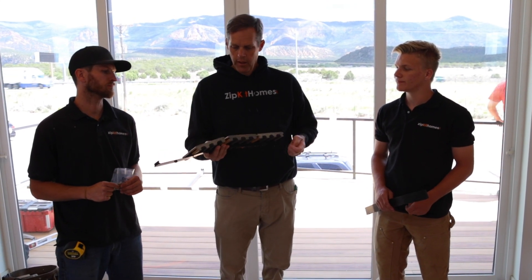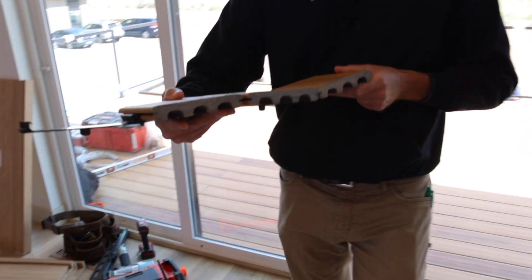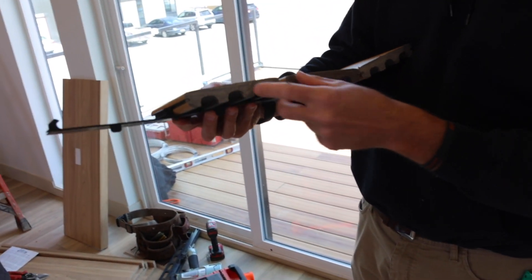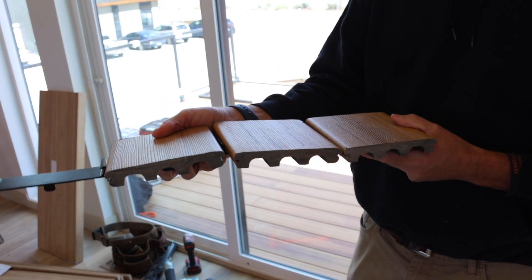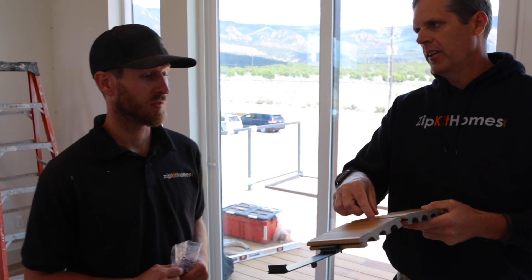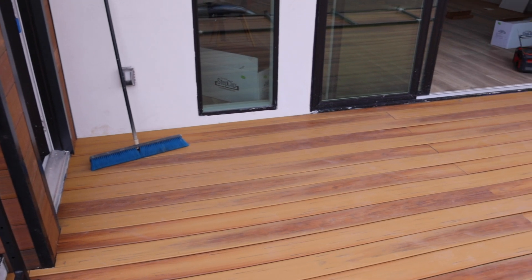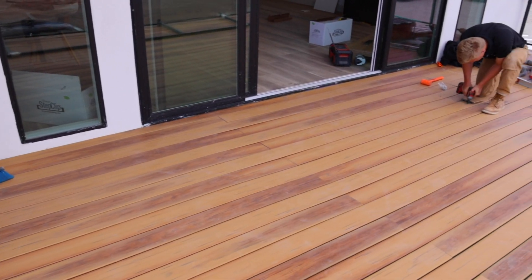I'm going to show you a couple of things here. If you zoom in on this, this is the clip system — you put this whole clip over the joist and then these just clip on. Briar, what did you think of the clip system? It's a whole lot easier than putting on a traditional deck. Why is it easier? You don't have to screw every joist, and it gets your gapping exactly right. Gapping's perfect on it. And when you look out at the deck, you'll see there's almost no fasteners visible. You're clipped in and all the fasteners are on the clip, but what you see from the top is almost no screws at all.